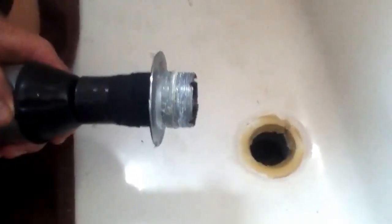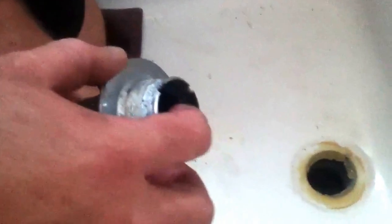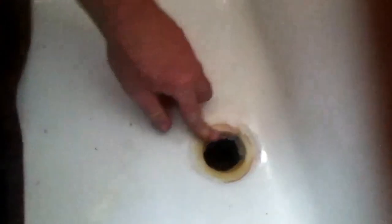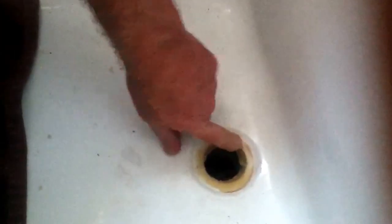Simple method: an air impact wrench and a socket just a little bit smaller than the hole, a little bit of force. You can see the socket is almost all the way through but not quite. That broke out a drain that had been held for eight years in silicone, where no other tool could do it. Hope it helps!